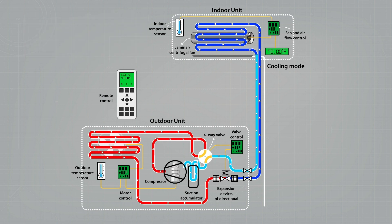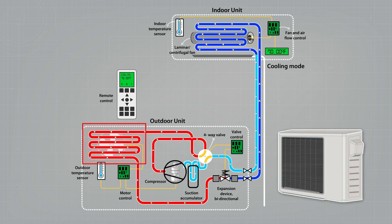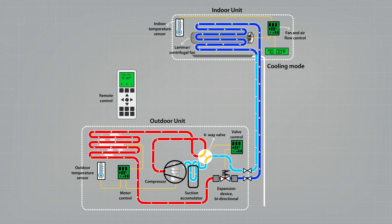Via some clever arrangement — we'll come back to that later — the evaporated refrigerant is pumped under pressure to the condenser, which is the most visible part of the outdoor unit because of the fan. The hot refrigerant is cooled down, which means the energy from the indoor cooling is released in the form of heat. The temperature can also be monitored here to control the compressor and condenser fan speed depending on outdoor temperatures — the higher the temperatures, the higher the speeds.